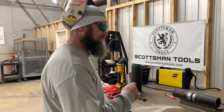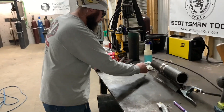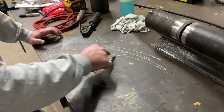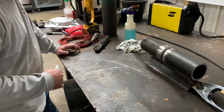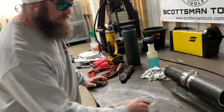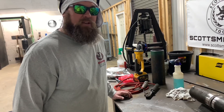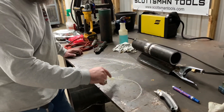Let's look at a little bit of the science behind it. The Venturi effect says that if you have enough flow here, it will cause a vacuum here. But all that is relative to the size of the hole and how much flow you have. The flow has to exceed the diameter of the orifice to be able to cause a suction. When it comes to the pressure behind argon inside the main argon line, if you get a hole there, you're always going to be expelling gas — not creating a Venturi effect. We proved it. The bubbles are always getting bigger. If you were causing a suction, the bubble would be getting smaller.